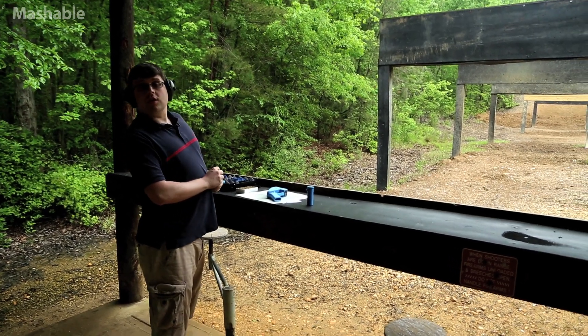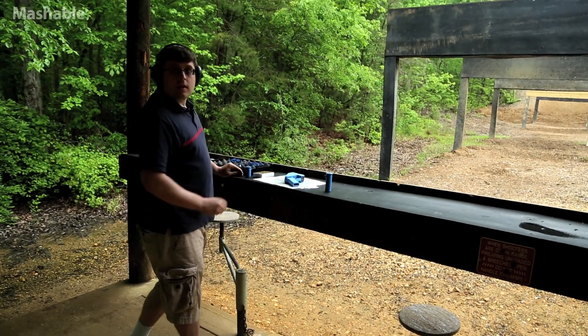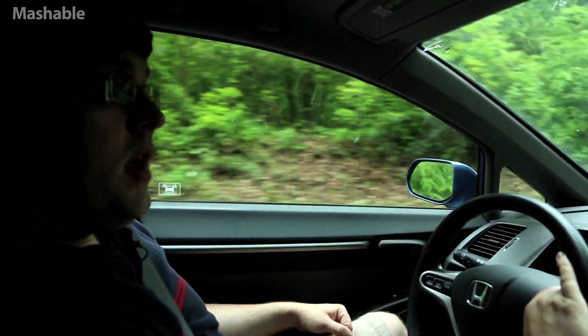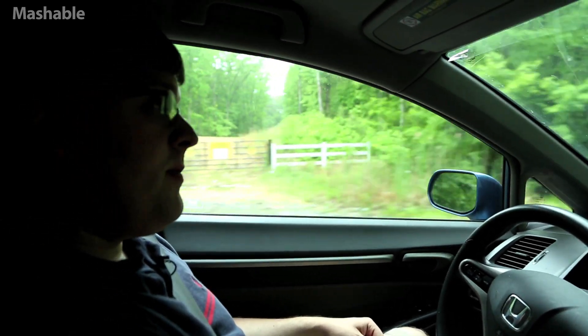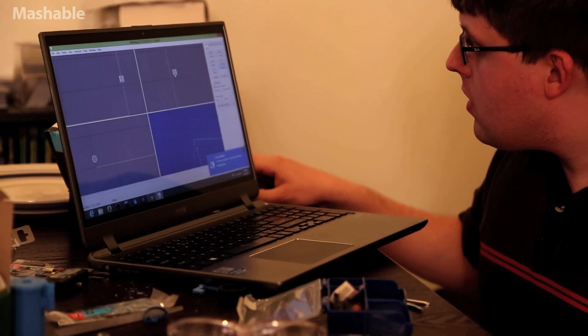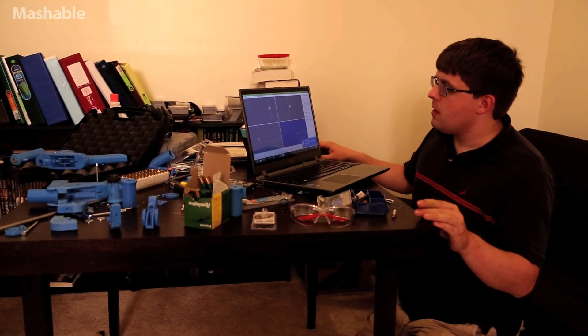It is not firing, so I think I'm done with it. We tried a few times — it was striking the primer but it's not going off. The primer is not taking enough force to actually explode reliably. I think I'm going to improve the firing mechanism and replace it with a more traditional cylinder striking pin. That's the process — it's never perfect the first time. You make a new one, give it another shot, and just keep going until it gets better.